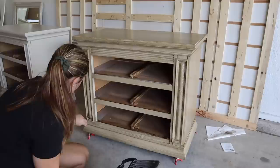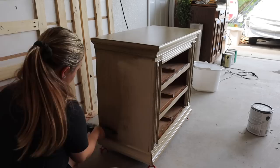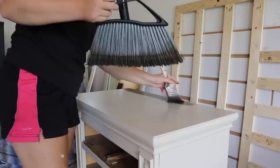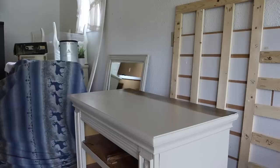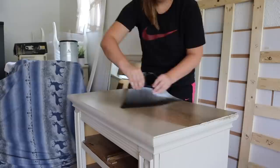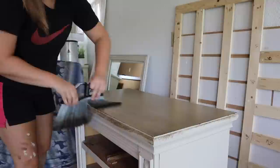The third thing that I would recommend is, depending on how dark you want your piece, I wanted mine lighter. I like the lighter wood colors. Make sure that you're offloading the bristles just so that it's not super dark. I think actually one of my nightstands is a little bit darker than the other just because there was that learning process and I didn't offload all those brushes. I might be the only one that can see that because I created it, but I think one's slightly darker and one's lighter. I can go back and fix that though, so I'm not too worried about that. Just make sure if you do want a lighter look that you're definitely offloading the bristles because it can catch a lot and it can make it really, really dark.